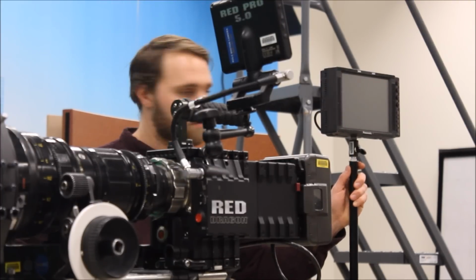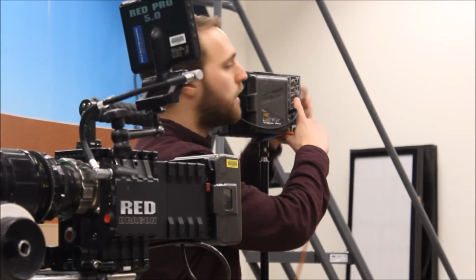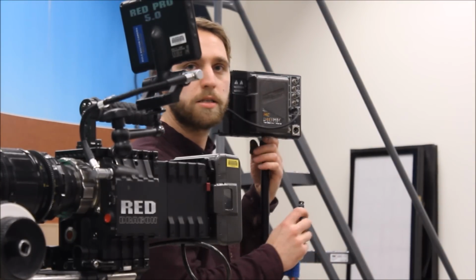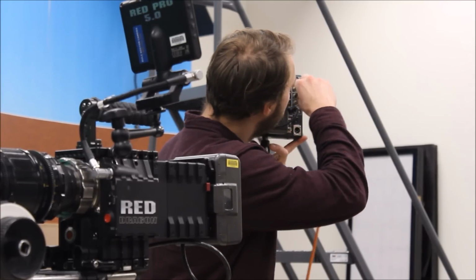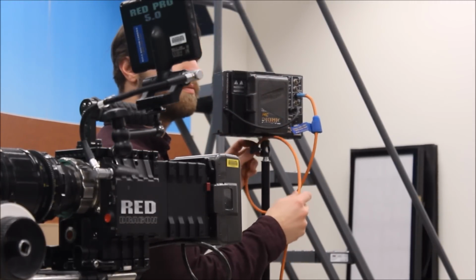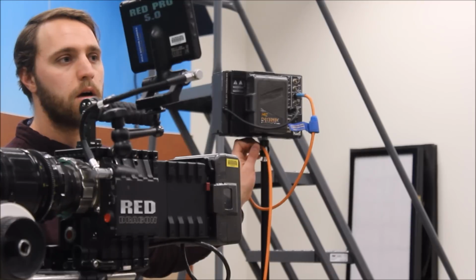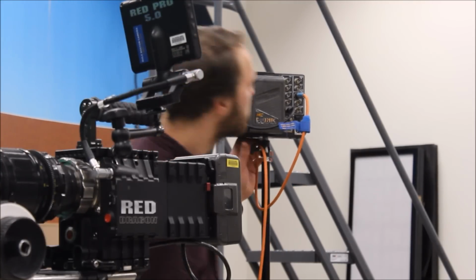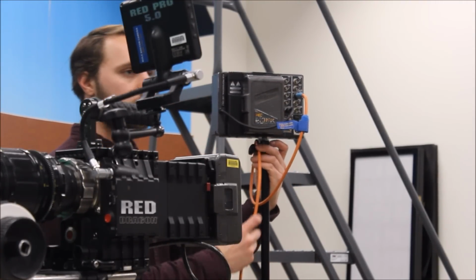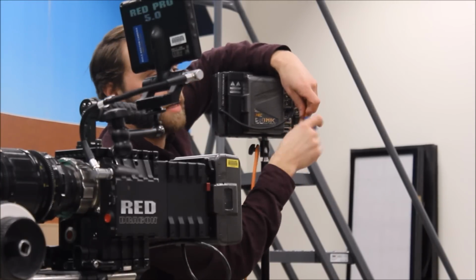So here's your BNC cable. We'll hook it up. We're going into the SDI input, not the video. This video is referring to a composite video signal, an analog signal rather than the SDI signal. The BNC is a twist lock connection. Is that different from a YC cable? Maybe like a three multi-cable? It can be. But this can go to the NTSC video input as well. The type coming out of here is HD SDI, serial digital interface. But the cable itself can transmit both, yes.